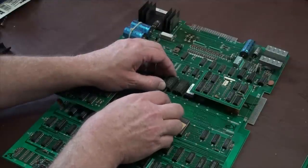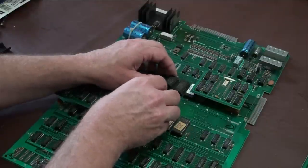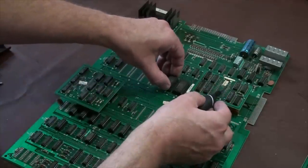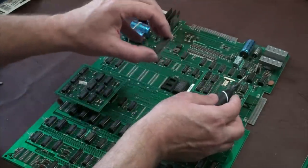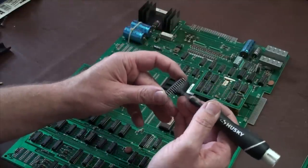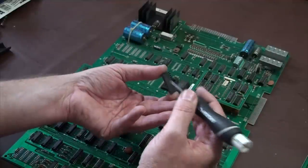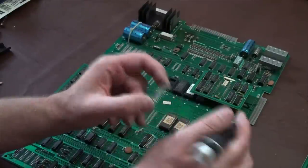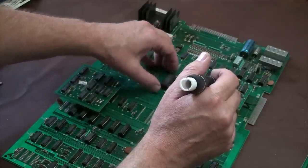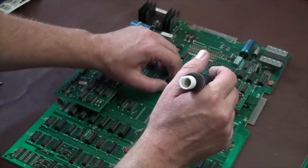But you kind of get inside there, and then you gently push, and you work that screwdriver up and under. And be really careful with it. And then after you kind of have that, you gently pull out, okay? And then from here, you can go ahead and look at all these. I've already cleaned these guys. I did that yesterday. You clean these guys up, you look at them, make sure that all the pins are intact, everything looks nice, everything inside here looks good, no loose connections, and then you gently put the guy back inside there, okay? So that's when you're cleaning your chips and you're looking at your chips.